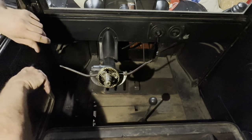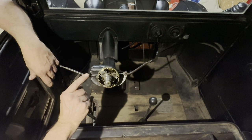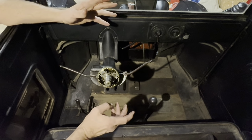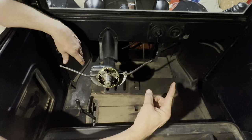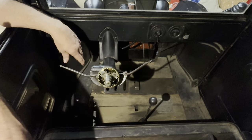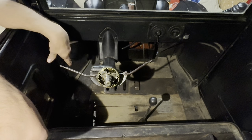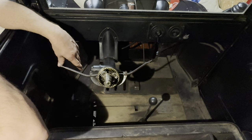So I was talking to Rob and Steven about this the other day, that you actually have a better advantage than the 4-to-1 ratio because you have a steering wheel, and from here to the outside of the steering wheel you basically have a very long lever of 9 inches. So you have the mechanical advantage of that 9-inch lever, plus a 4-to-1 ratio. It's not just the 4-to-1 ratio that makes steering easier. It's that lever on the end of it.